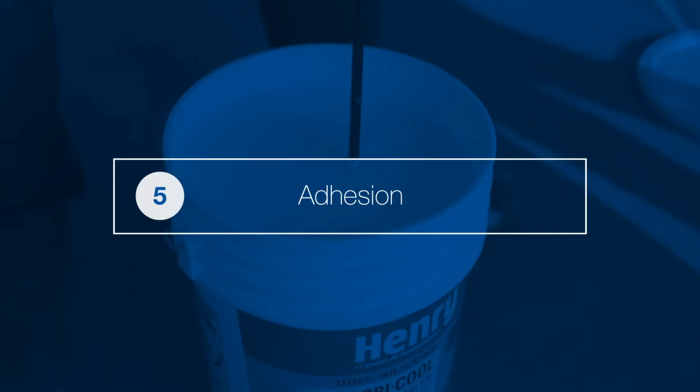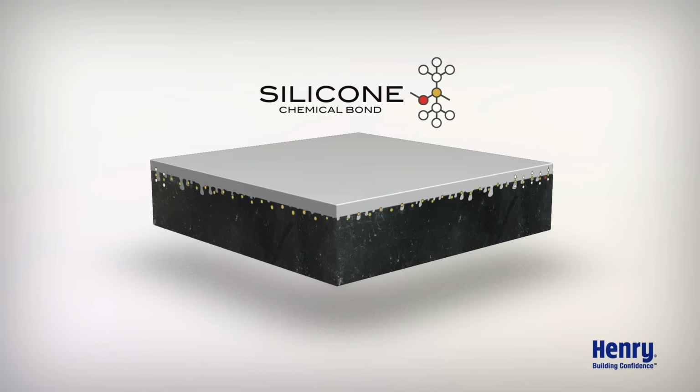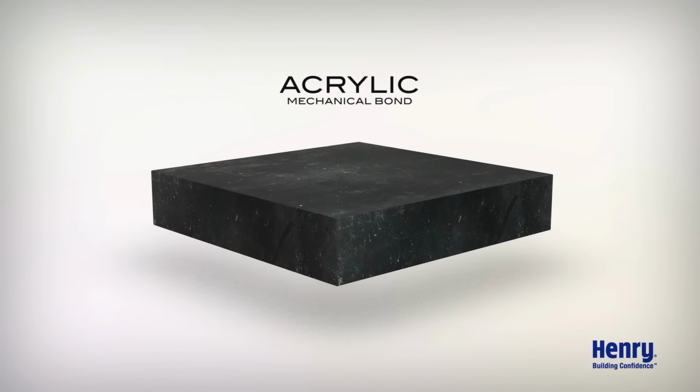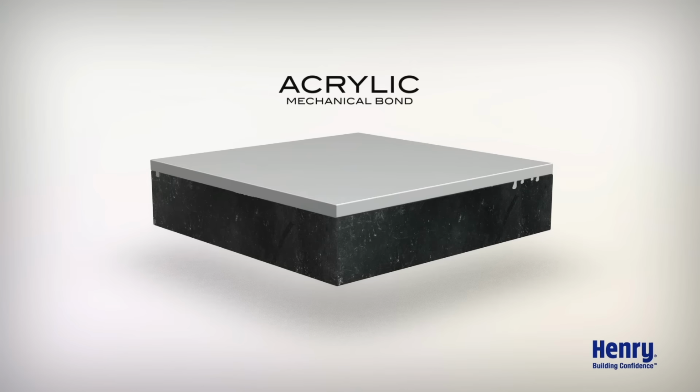Tropicool 100% silicone creates a strong chemical bond by cross-linking silicone molecules to the existing roof surface, resulting in a 30% stronger bond compared to Enviro White acrylic, which relies on a physical bond that sticks to the surface of the roof.